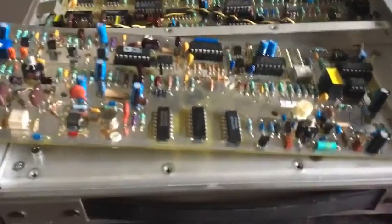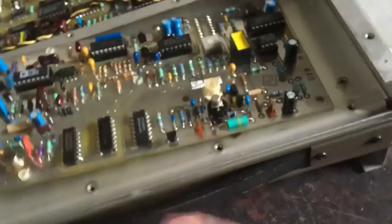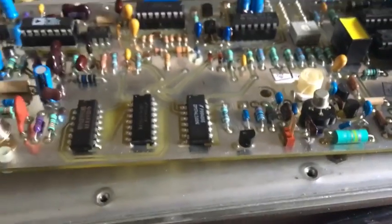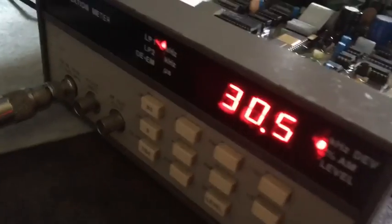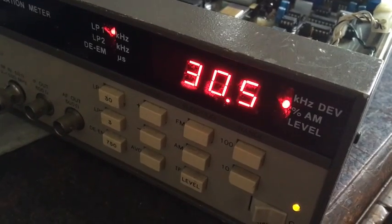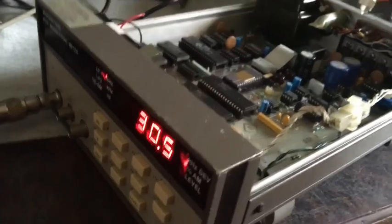Back to these ones now. The new diodes have arrived today from RS — 1N6263s — to replace those two that I've already half unsoldered. I'm going to replace those, put it all back together and see if that fixes it. I've just replaced those diodes, reinstalled the unit, and there we go — it's working again. 30% modulation on AM, and that's what it's showing — 30% — so it's all good. That's working again, repaired.